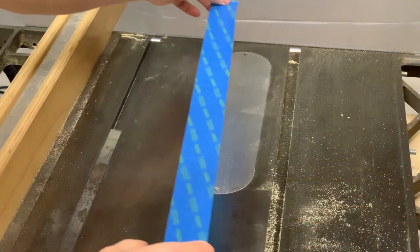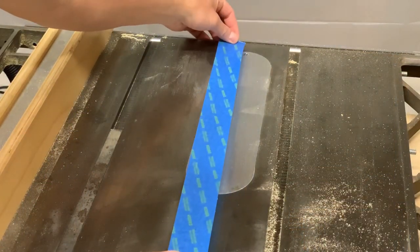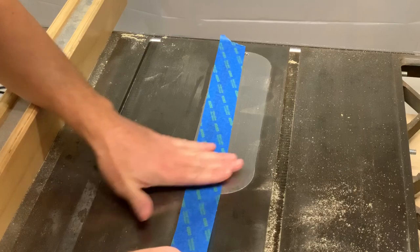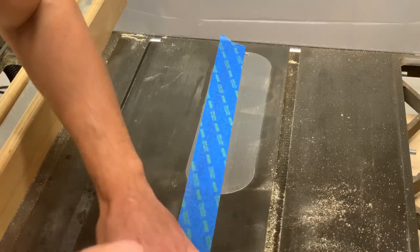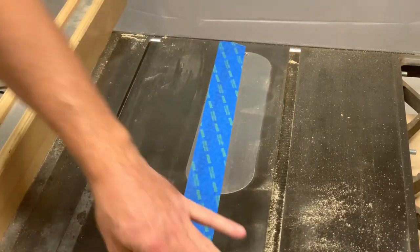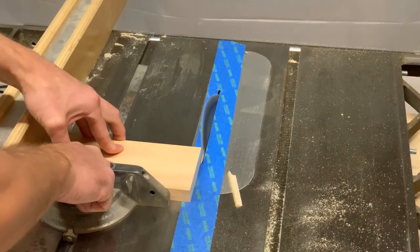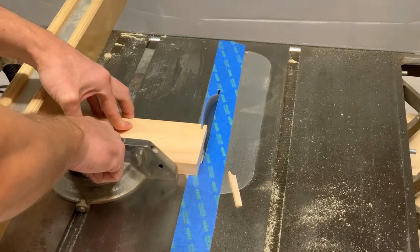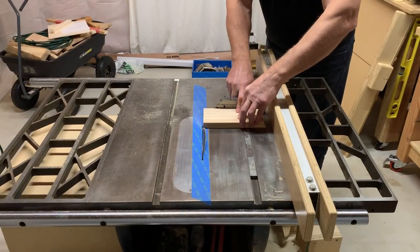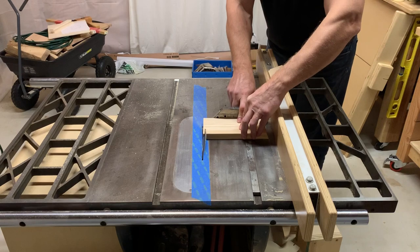While I was doing my best to prevent kickback, I don't have a zero clearance throat plate, so some of the little off cuts were falling down by the blade instead of falling away. That can be dangerous too, so I decided to put some painters tape down and make a temporary zero clearance throat plate. This worked great, but it also introduced another problem. Remember that discussion of how even slight differences get compounded across all the joints? Well, the tape introduced one such slight difference. I ended up doing another round after this one, without the tape, to clean things up and get the angles correct.